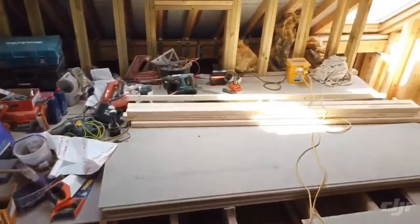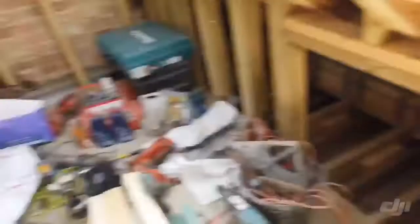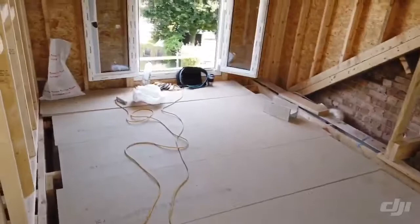The lads are busy starting to tile and stuff like that. On this one we've re-roofed the whole roof — the front of the roof we took it all off, put new breathable felt, batten, and new antique brown Marley plain tiles. It looks fantastic — literally all fresh, all new, and no need to worry for years to come.